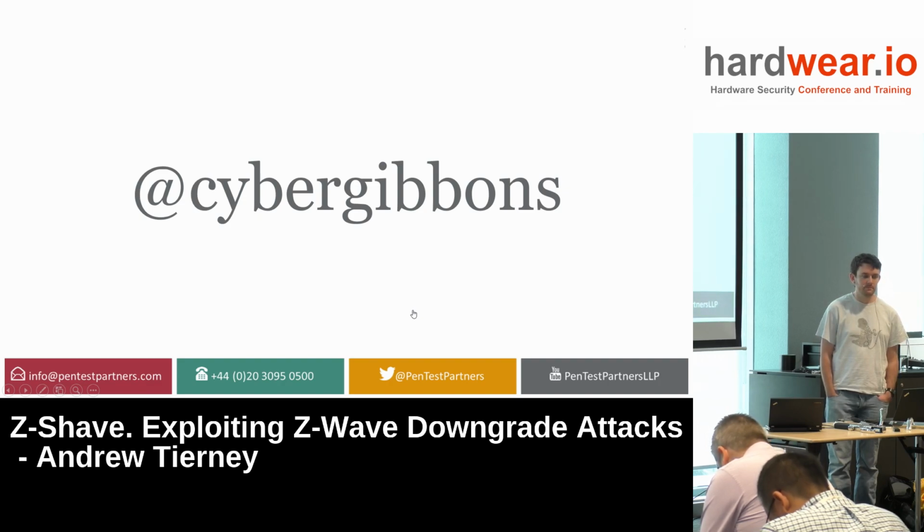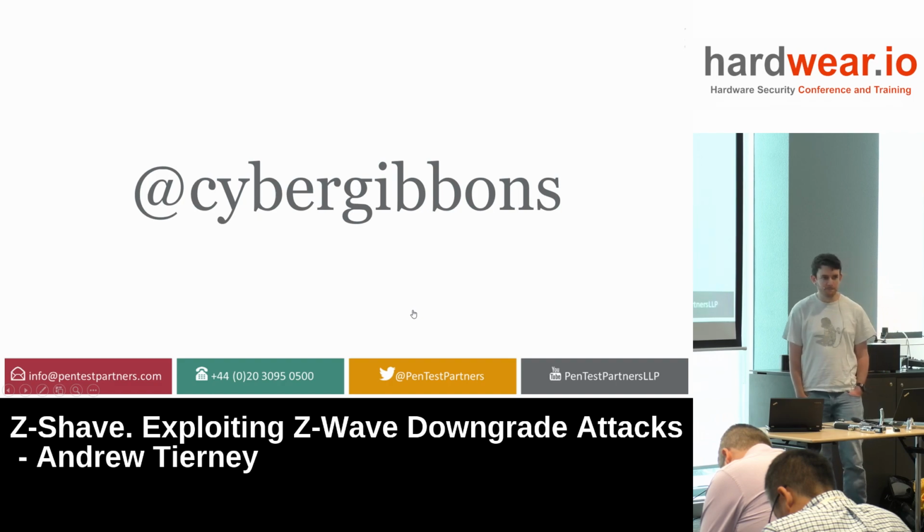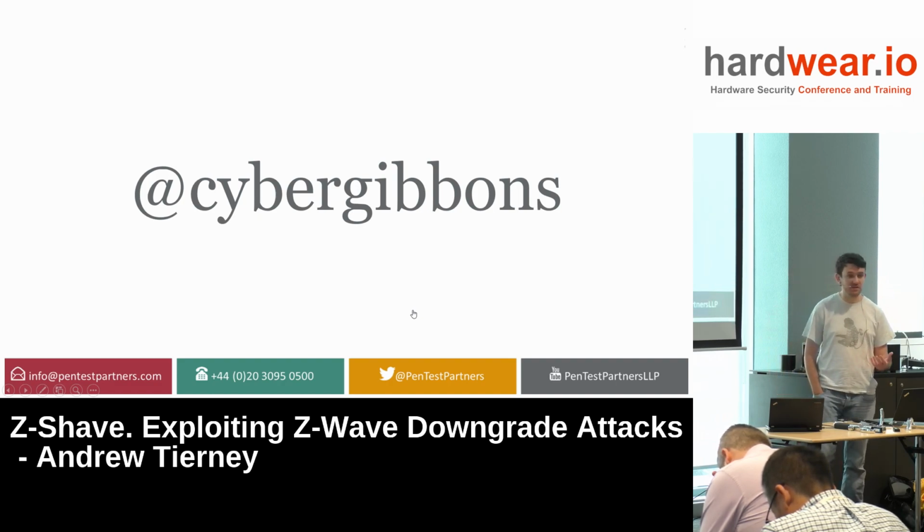When you actually send the replay message, the controller is going to receive actually two messages at the same time. Or did I miss something? What we do is the controller isn't in the pairing mode when we first start it. So the node sends its info first, and then we put the controller into pairing mode. Now the problem is you've got a bit of a race going on here. The device will keep on sending out that node info every 2 seconds to start with, then every 4 seconds, and then every 8 seconds. It backs off. But if we don't get our node info first, then the attack won't succeed.